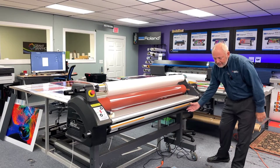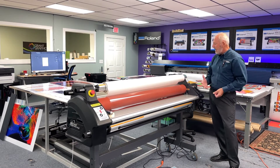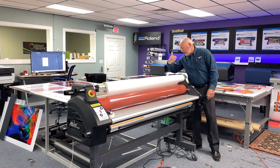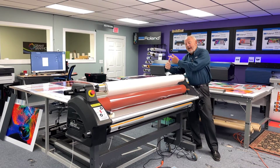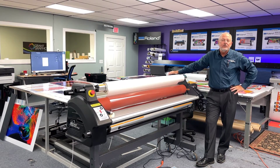A machine like this is easy to load, with beautiful clutched mandrels, nice media feed, nice large rollers, heat assist options, and clutched take-up and source roll mandrels. We have slitters in the back that allow us to slit the graphic as it's exiting the machine. We can control it from the keyboard or the other side. We have foot pedals and lots of different pressure adjustments.